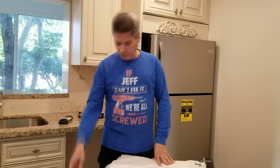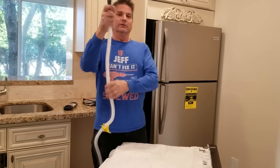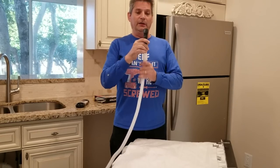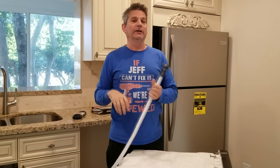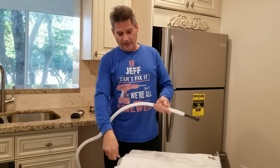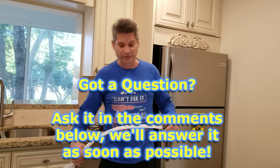Now I'm going to remind you throughout this video so you don't forget: every dishwasher has one of these drain hoses that goes and connects to your garbage disposal. Before you connect this up to your garbage disposal, there's a plug inside that port that you've got to knock out with a screwdriver and a hammer. If you fail to knock that out, all the water will back up inside your dishwasher and fill the bottom, and you'll be wondering why water is collecting in your dishwasher.